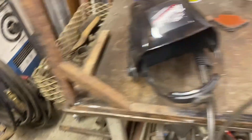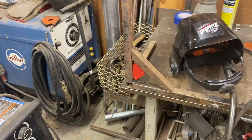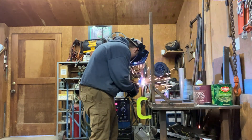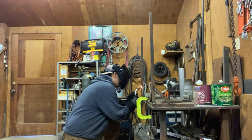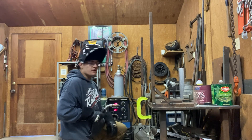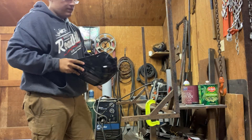That is the nicest looking one I've had. These have all had gaps, but this one has basically no gaps at all. So I'm going to stick them right along this line and it fits in there really, really nicely. Welding gloves graciously decided not to run away this time. Those welds do not look great, but those ones are pretty much flush so you don't really notice. These ones are kind of sticking out, so I'm going to have to do some grinding. Thanks to metal warping, this has got a bigger gap on this side, unfortunately.